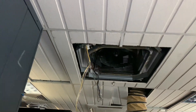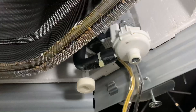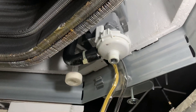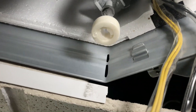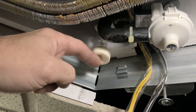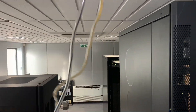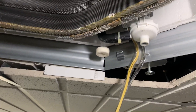So that's it — now we've got the unit exposed. That there is the lift pump, and that there is the float switch. So the lift pump sucks water up from the bottom and pumps it up this tube and out of the unit. Next to that, that's our float switch — if that pump fails and the water starts rising in the tray, it rises up that switch, gets to the top, makes the circuit, and closes — sending a signal into that PCB on that plug to shut this unit down in an alarm.